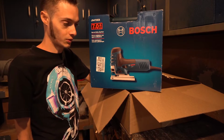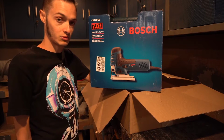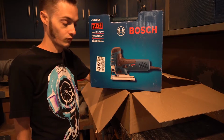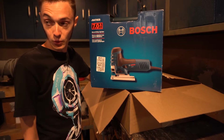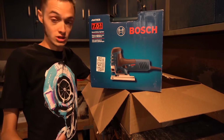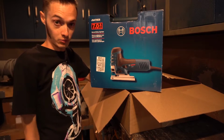So we're gonna use all this to mock up pieces. It'll be really nice because we won't have to hand fabricate things. At least we'll use this for our big pieces that won't fit on our plasma table, frame plating, big 3-link bracketry, or 4-link bracketry. Because we'll build 4-link suspension kits, with the 3-link on the front of the truck and a 4-link on the back of the truck. We'll make one singular bracket that mounts on the frame for the front and rear suspension mounting points.